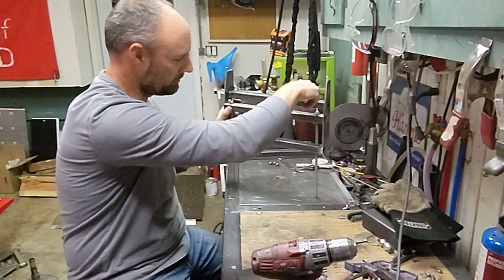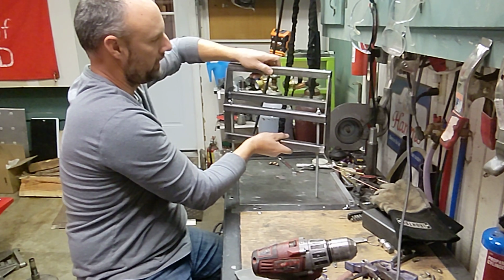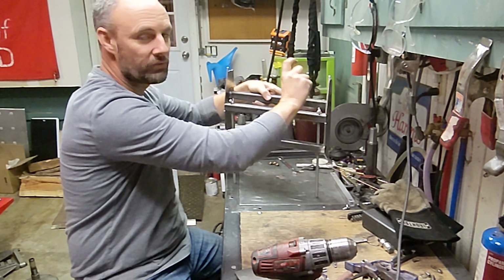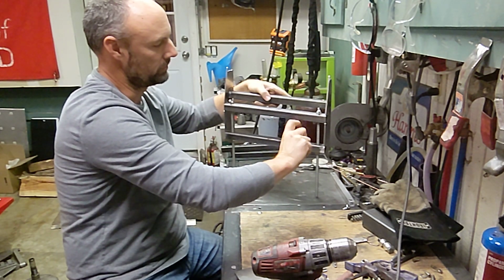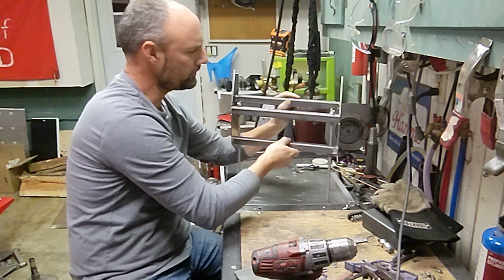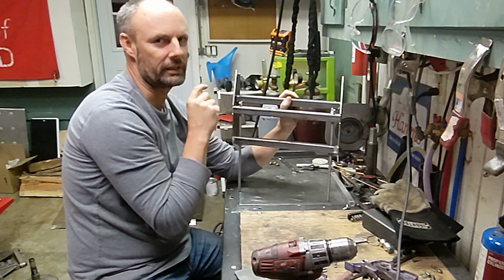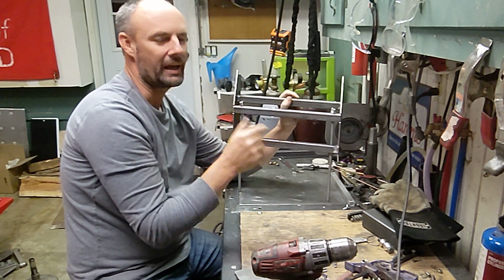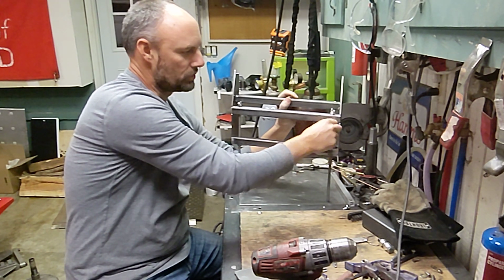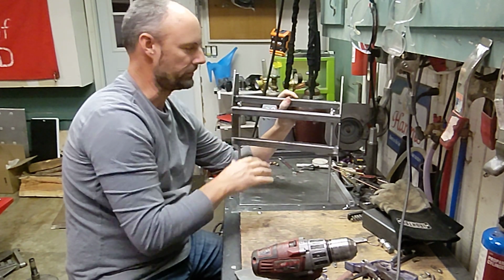And then up here, there's another bar that's missing on top there. There's another bar that sits up here, and that would be the upper control arm mounting point. And those are both oversized, so that you can adjust your mounting height on the frame of your upper and lower control arm. Why would you want that? Because that allows you to adjust quite a few things geometrically on the car: your front roll center, anti-dive, all that fun stuff. So basically by sliding what will be a Heim joint up and down on a grade 8 bolt that goes through here, that will adjust all those mounting positions.